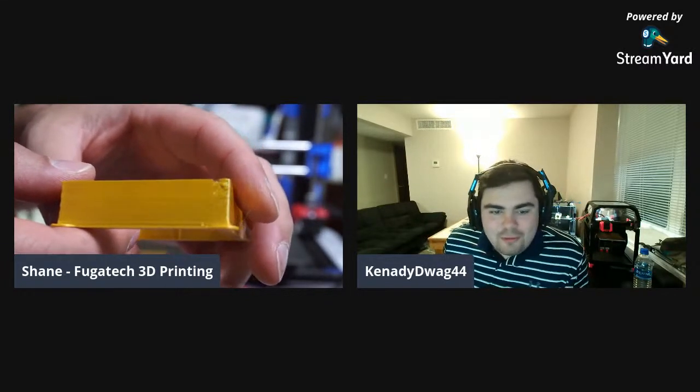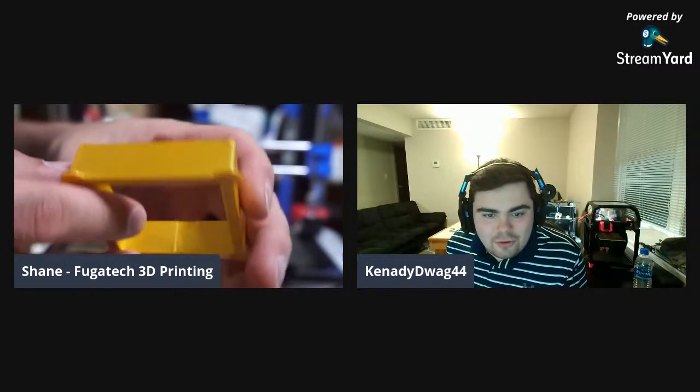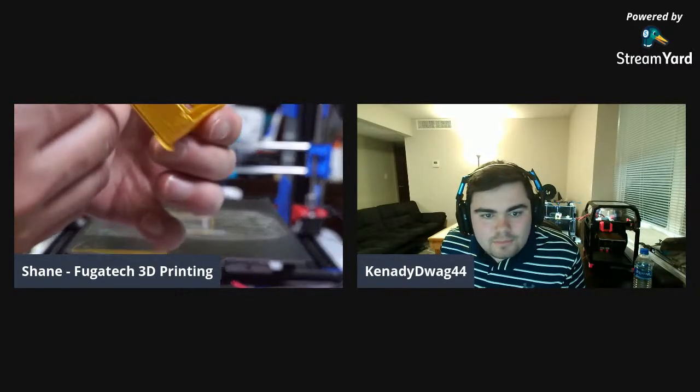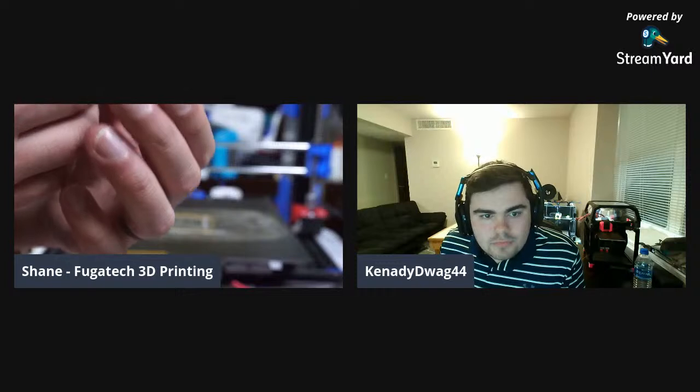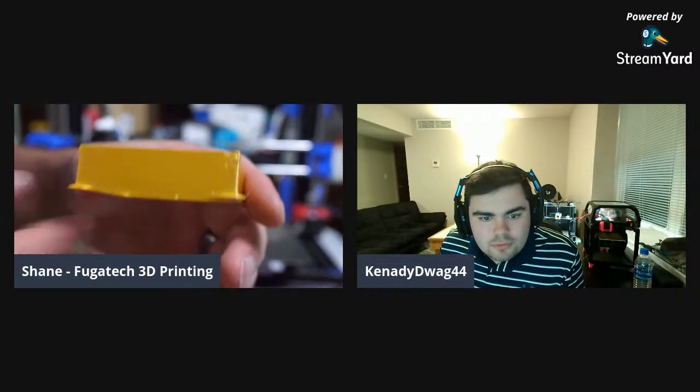Especially with that's silk filament, right? Yes. So yeah, silk tends to overheat a little bit quicker than other filaments. So should we retry it at a different temperature, or what do you think? I'm sorry, different temperature, speed. I would maybe up the temp. What temp was that at? 215. Oh, that should be fine. So maybe lower the speeds a bit. You could probably get away with like 60 millimeters a second.